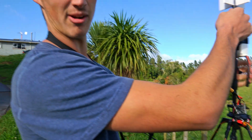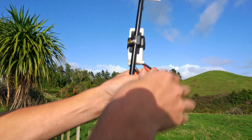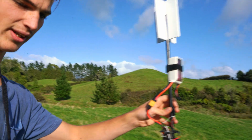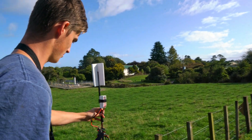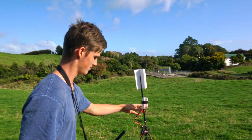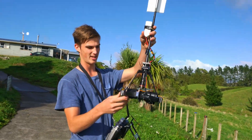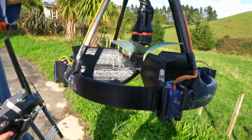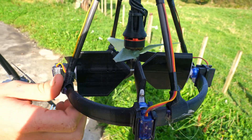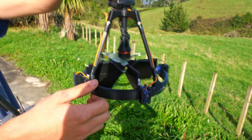I need to design a proper battery mount for it, but for now just a strap and a bit of foam works quite well. It has to sit level on something just so it can boot. It kind of fights itself. So in iNav I've gone into the custom mixer — you can see down on the base here I've mixed it so that pitch forward, pitch back, roll left, roll right all work, and it also has a PID loop engaged for all three axes.